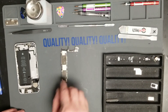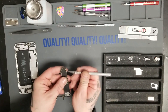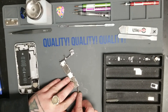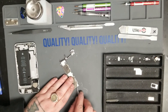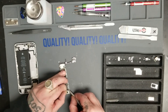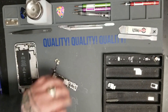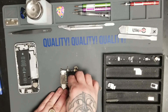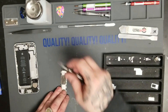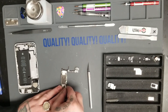On the back here you'll notice there are two stickers — one there and one there. We're going to take these stickers off because it gives access to a lot of hardware that's actually on the board. Otherwise it wouldn't be able to get in there and get cleaned up. Think of it like this: you have something sandwiched in there with minerals and deposits on the board. If you don't open it up like this, you're just shaking things around inside and it's not going to do you any good — same as just soaking a phone in isopropyl alcohol and then drying it out in rice. You're still going to have residue. So open it up and give it the best chance you can at coming back.